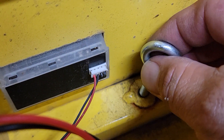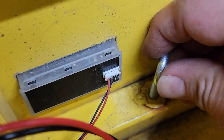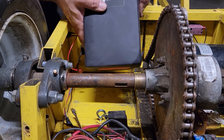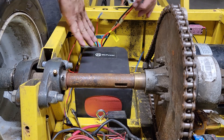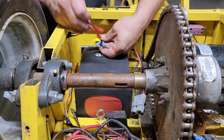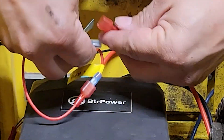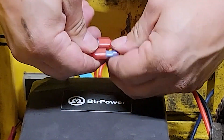This one might be a little bit difficult because it's going to be really close to this panel right here. If for some reason it's too close, you can always loosen the screws on this panel and pull it out just far enough to get this threaded in. Now we can go ahead and put our battery pack in place. Slide it in here, making sure it's right side up. Make sure there's nothing underneath it. Make sure you have your connection wire, and you should have two charger wires right here. Go ahead and connect these to the charge port — red to red, black to black. On these connectors, if they don't want to go in, just turn them around; sometimes you just flip them over and they'll go right in. Make sure these are fully seated.